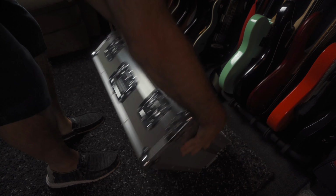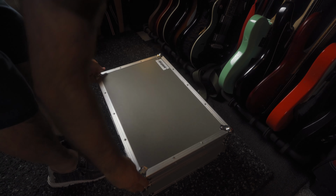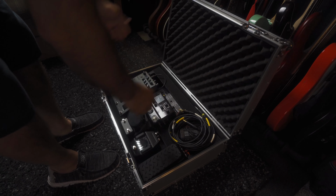And these things worked great. I tested them with a multimeter, and like I said, at first, I ran into an issue where I did not push the wire in all the way. That was on me. So you really want to push it in there, give it that bend, and then put the cap on. Once I realized that, I undid it, pushed them in there, bent it again, tied them down, locked them down, and everything was fine. The pedal board was working flawlessly. And I'll show you a little bit of B-roll on what that looks like.